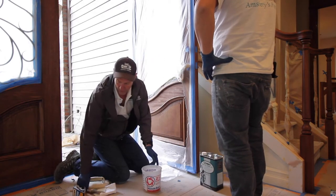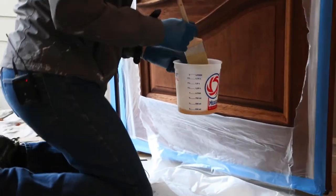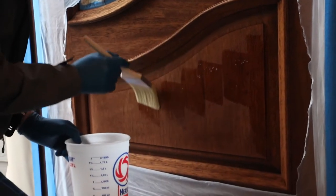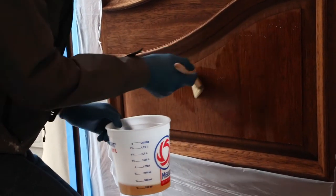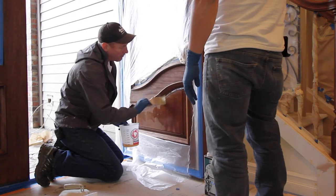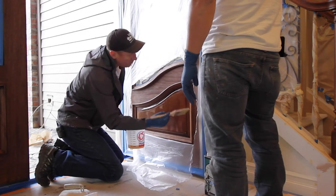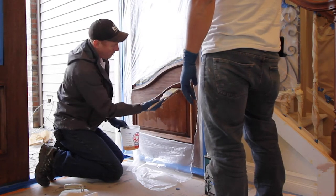I've got a clean bucket here to work out of, and I've got my brush. This is very runny, as you can see. So I'm going to put very little product on here. My goal is to get a feel for how it runs and see how it starts running down the door. I'm going to get up here and unload this. Just kind of work it in — it doesn't need much, a little bit goes a long way. You have to make sure that you get the oil on every single surface. You can actually apply an excess amount and it won't hurt anything, but you do have to pull all the excess off. I'm doing the demonstration on a panel so I can leave the sheen in one location and not have too many coats in one spot.